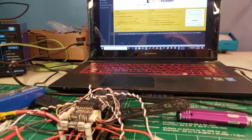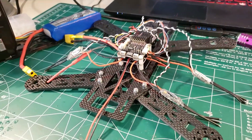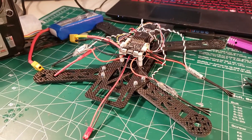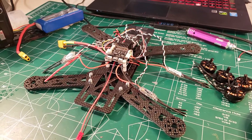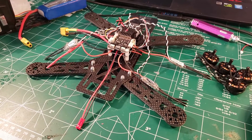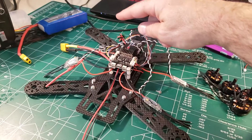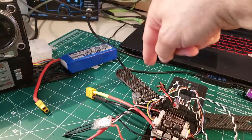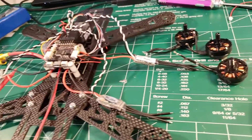Those of you who have been following the series are sick of me talking about that. So what's missing in this picture? Motors! We're going to get the motors hooked up on those arms. From the previous video, you know which motor is which and which direction each one travels. Betaflight has a map for you, but essentially this is motor one, this is two, this is three, this is four. One travels clockwise, four travels clockwise, and the other two travel counterclockwise. Your motors are notated on the side with their direction.